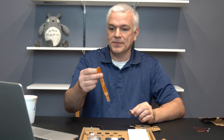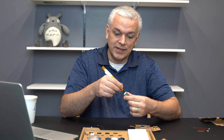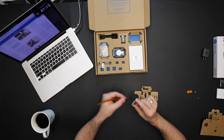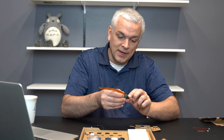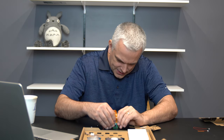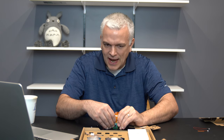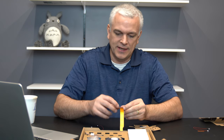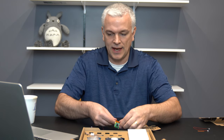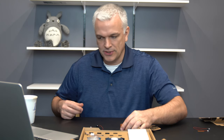Okay, so take the connector, black side up, because you want the copper connectors touching the conductors. Okay, so I'm going to put it in, and I've made a mistake here. This takes a little bit of effort the very first time. So what I like to do is make sure it's seated correctly, perpendicular, and then push the latch down, and it will kind of snap. You can feel it connect, and you can see that there's no gap there, just a single line. So that's good for the latch. So that's the camera, and I may be touching that. I should have removed the strip, but I'll just make sure it's clean.